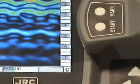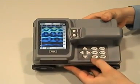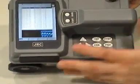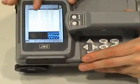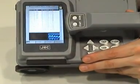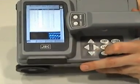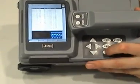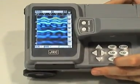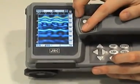If we want to review the scans collected onto our compact flash, we press the CF button. This moves us into a menu with a time log of each file collected, as well as a little thumbnail image to remind us what the scan looked like. When we want to move out of this, we press the CF button again and we're ready to start scanning. There's no need to clear the screen — we can just press the Start button again.